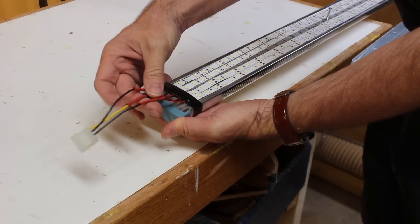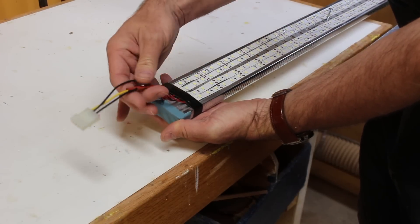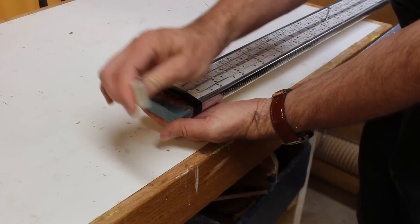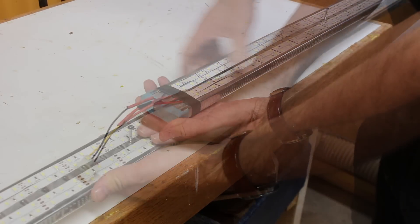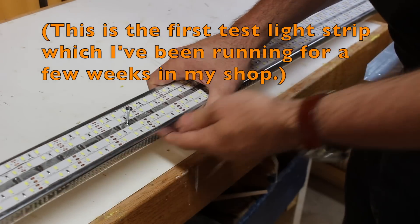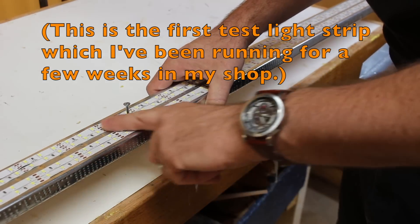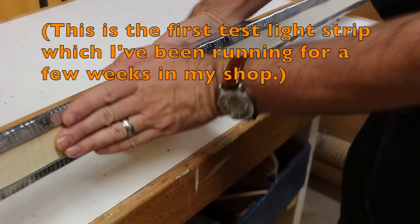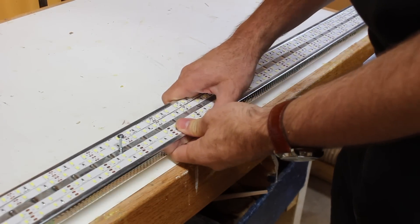Here at the end I soldered the wires together and hooked them up to an old cable I clipped out of a surplus PC, so that this can plug in nicely to the power supply and then unplug again when I need to move it. These are warm but by no means burning hot, which is what the ones mounted to wood were. The glue has shown no indication of letting go, and you can actually feel the heat moving through the whole stud, which is dissipating it — which is exactly what I was hoping for.